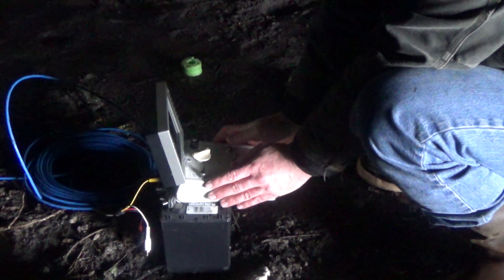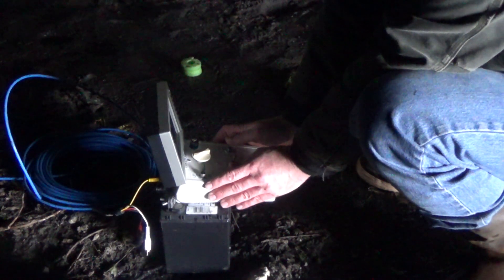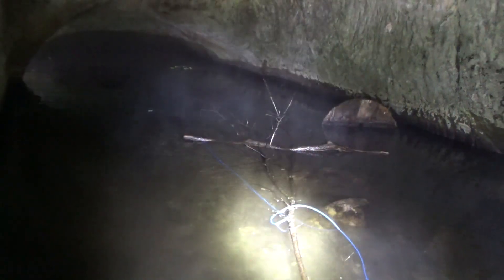This thing actually cruises along at a decent speed underwater — I'm surprised — and it's getting all that 12-volt power down the ethernet cable to those thrusters. Once it's ballasted properly it can dive and then surface. The tether is now tangled on a stick in here. Tethers are nice because if you get stuck you can theoretically pull it and bring it back, but when it gets tangled on debris in the cave, that gives you the opposite problem where you can't move ahead and can't necessarily pull it back unless you're close to the tangle.